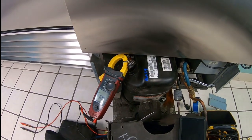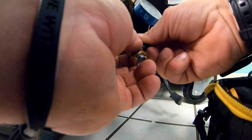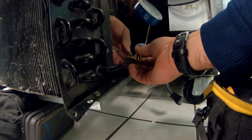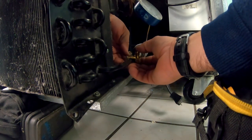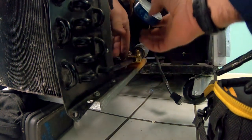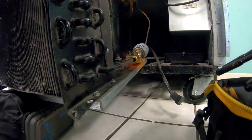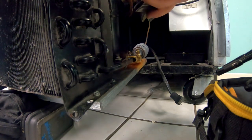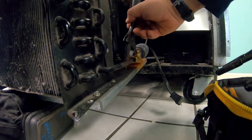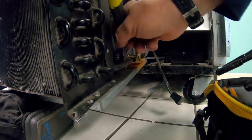At this point, why did it do it up until now? We have to tap it to find out. I'm going to use this just for tapping purposes for right now, then take it back off. I can use them on my R290 units, and I usually change them out afterwards. I can always drill this — it's a lot to tap into it. Right now this will work to get me pressure. I don't want to disturb it — I could just pull the charge and weigh it back in, but I want to know if I'm actually fixing the problem and not just hoping.